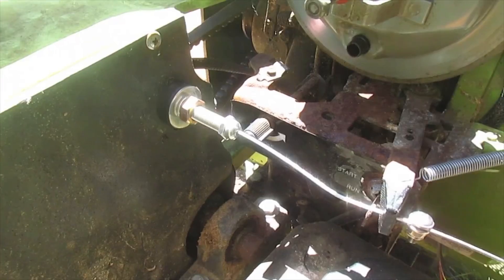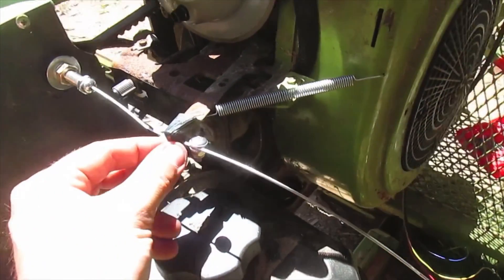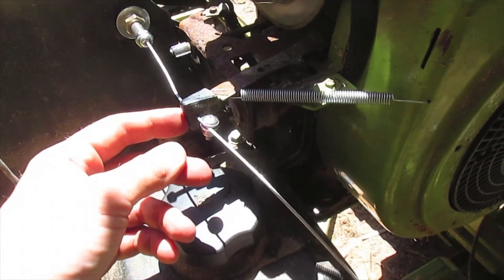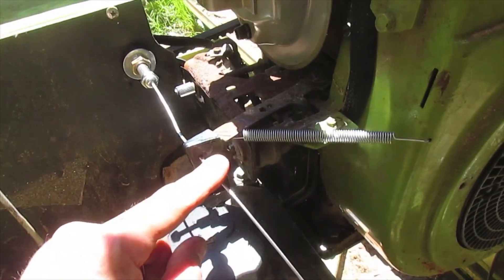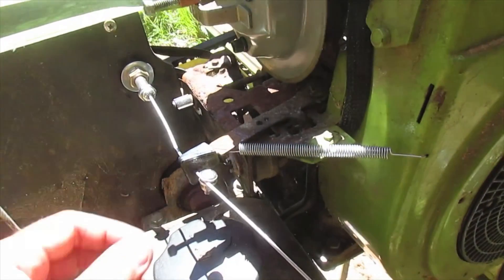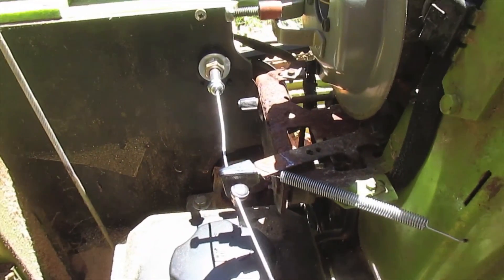Here's how I have it mounted — the cable comes out through this housing right here. This is the original throttle and I want to keep it in case something burns out. I always like to make my mill so I can still run in manual mode — I just disconnect the cable, pull a spring off, and tighten the jam nut again. I can still throttle it up manually in case one of these components burns out.